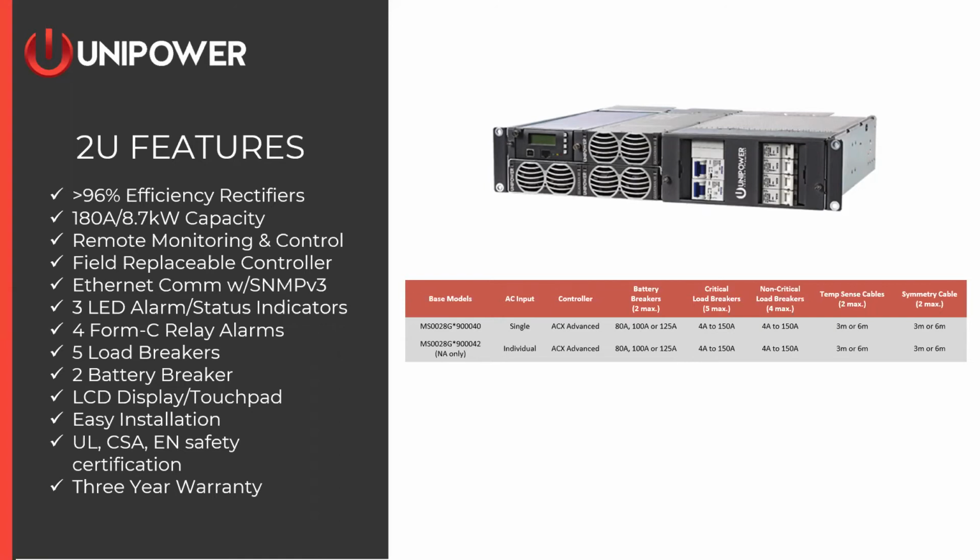The 2U unit comes with 4 Form C relays for alarms, 5 load breakers, 2 battery breakers, and the LCD touchpad. You can control this from the front of the unit from the ACX controller if need be. Very easy to install. It's a rack mount system that can go into a 19 or a 23-inch rack with adapters, and they are UL covered.